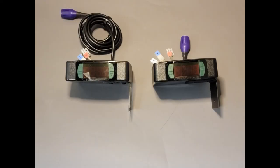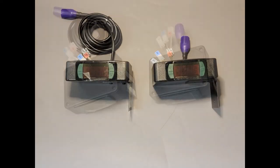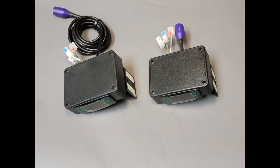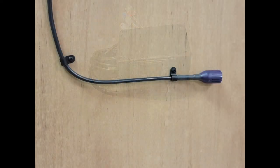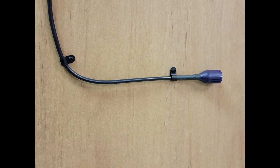The second configuration is the angle mount bracket with long sensor. This allows for when you cannot put the controller in an optimal humidity-sensing position. It allows you to place the controller within a drawer, in an easier-to-see location, or even exterior to the humidified space, and then run the sensor on an eight-foot cord to where it will optimally sense the humidity within the space.